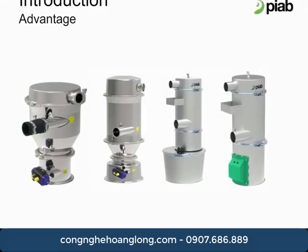Some additional advantages are highlighted here in this slide. Our fully pneumatic system is a perfect fit for intrinsically safe environments. Our range of filters from 5 micron down to 0.5 micron means we can handle a multitude of different products. The completely enclosed design ensures a clean, dust-free environment.